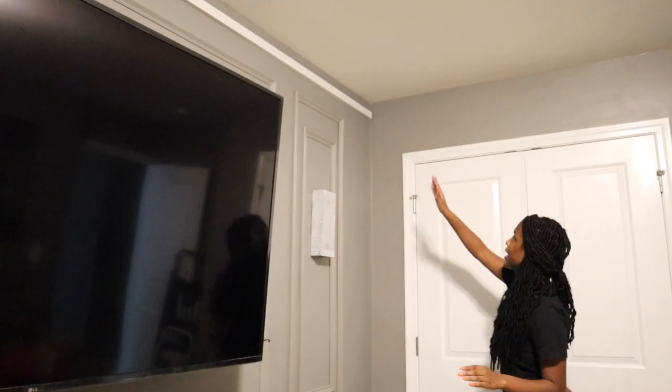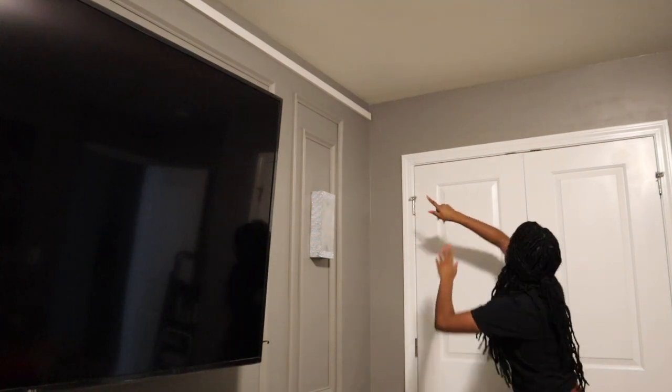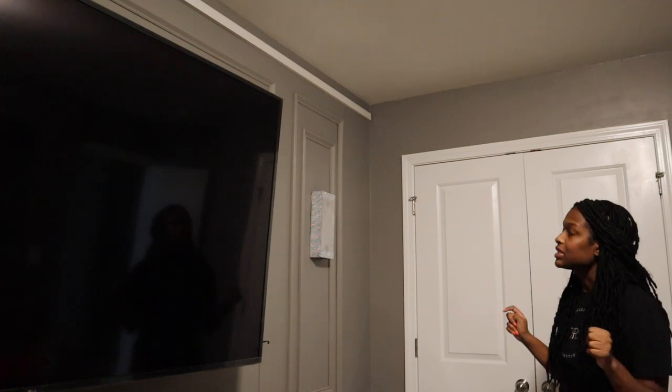Really, where we left off, I created like a little beveled, angled cut on that wall. So I need to get this wall. This wall, I think we measured was 76 inches, and then do a slant cut inward for an inward angle. And then on this side, I need to do an outer cut angle. So I really need to be smart about how I do these cuts when I go downstairs. But yeah, pretty much that's the system that I'm going to do across the entire room. So not sure how much I need to actually show of that, but that's the step that we're completing, is just putting on all of the base trim.